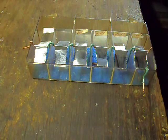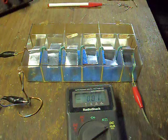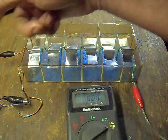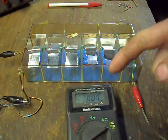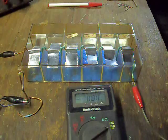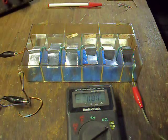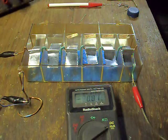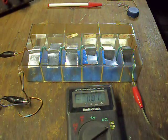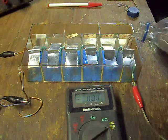It's ready to put your water in. It's ready for filling. I've got a three-volt LED, one that I showed in the earlier video, connected to the battery with a current meter in between so you can see how much current it's producing. Since it's a six-cell battery and a three-volt LED, it should fully load the cells to where they will produce a pretty good majority of the current.